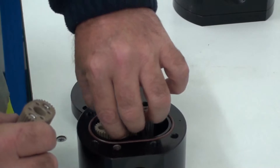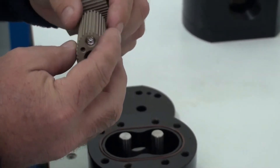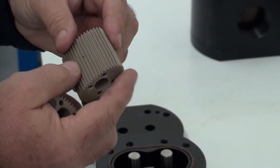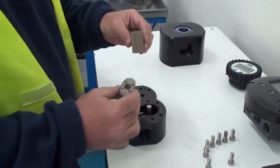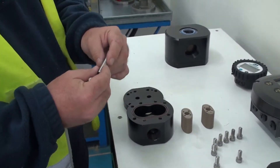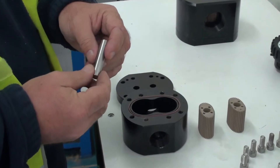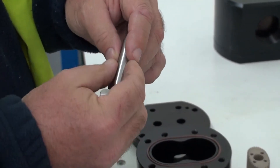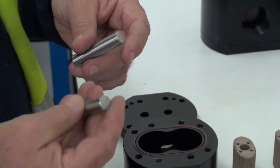We remove our two rotors and physically inspect them to make sure there's no damage — no missing teeth, nothing jammed in the rotors themselves. They all look okay. I like to put them in the position that they came out. With the MX range you can also pull the rotor shafts out — one good feature of this meter is that we can replace the rotor shafts. We check them for any galling, any chips, any damage that will reduce or stop the rotors from turning. They all look nice and clean.